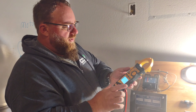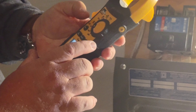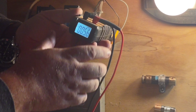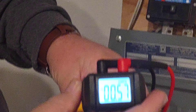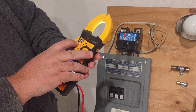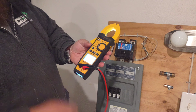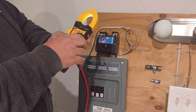One feature this particular meter has is that you can also read the amperage from the bottom of the meter — really useful if it's stuffed into a panel. The meter I recommend everybody get for under a hundred bucks is the Ideal 61-747. Not a requirement, but it does everything we do at our company very well. For the solar industry, this meter has a great features-to-price ratio.